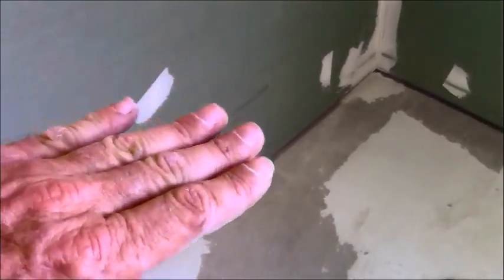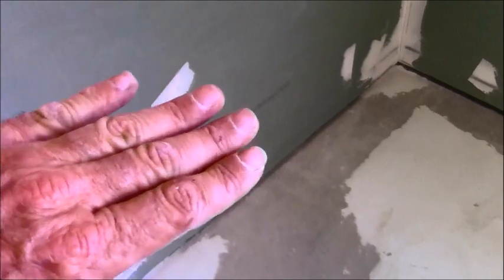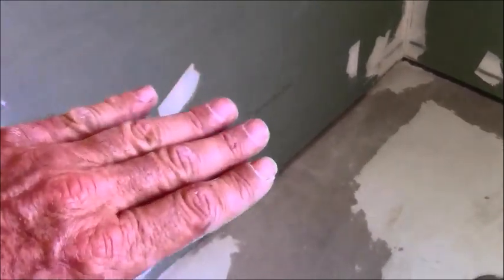And back in the day that was true. We had 4" by 4" ceramic tile with non-sanded grout that's very powdery, that was probably mixed too runny to begin with. It's weak, it doesn't work, and water gets behind that, and it begets problems with mold and mildew when it gets into your gypsum. Understand, that's where you have the problems. In situations like today, we're not doing that.